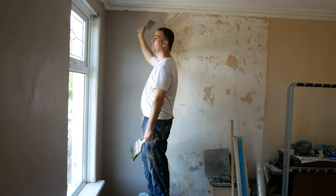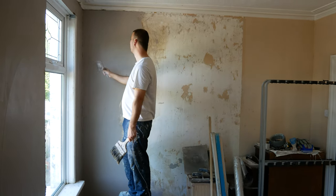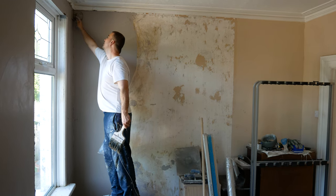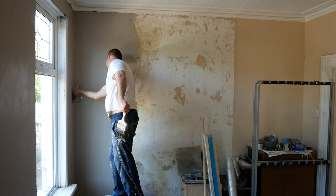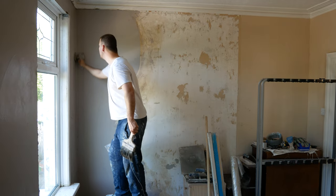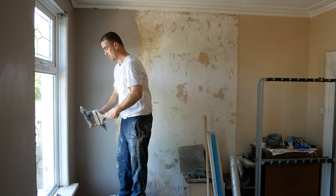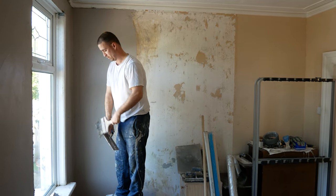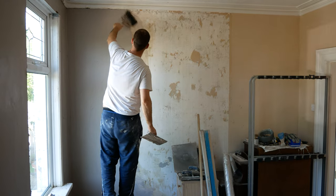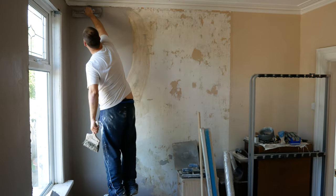So I'm on the patch here. I've got another wall on with a wet angle bead. If you're watching this you're probably doing plastering and patching, so you'll just be doing each wall separately — that's what I'd recommend. What I have to do is shape up the corner; if it dips in and out you fill it with your trowel or a bit of speed skim. I've straightened these walls so the corner is pretty good. The main part of the patch is actually where it joins the old wall, so get that all flush. When it's painted it will look nice and original.